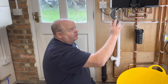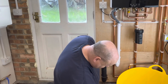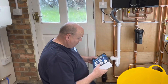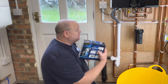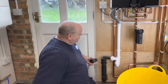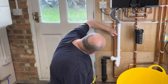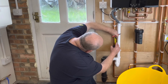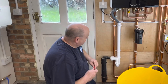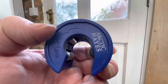I've fully drained the central heating system down — I've isolated the central heating part and drained this section of pipework. I'm just going to cut some of this pipework out here. I've got myself some brand new cutters to make it easy for the video. On the back of the unit it tells us to cut out 46mm of the pipework. So we'll mark on there with a marker pen — 46mm — and then we'll cut this out. We can see the arrow on the cutters showing which way to turn.